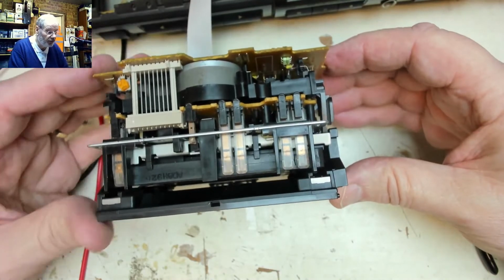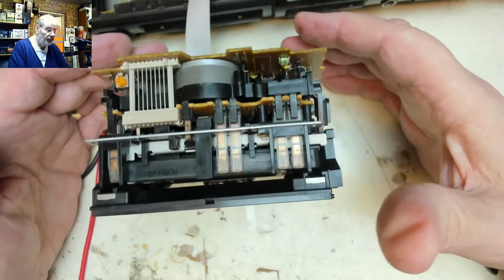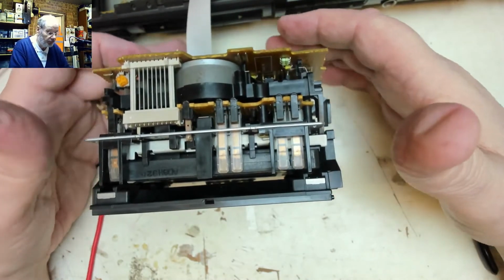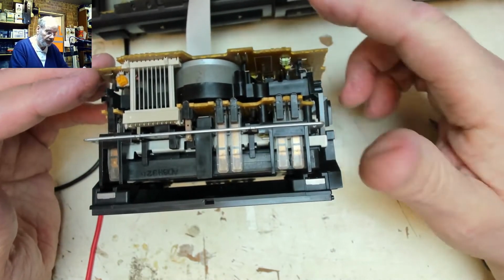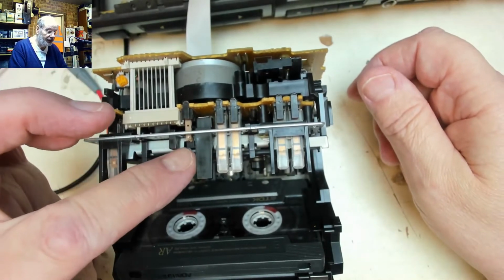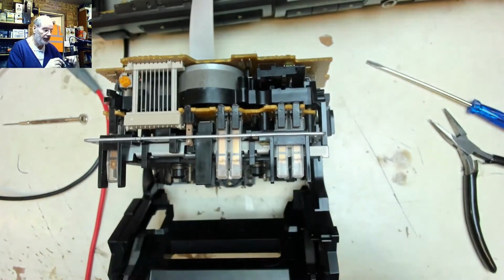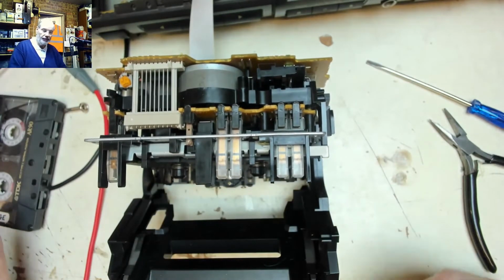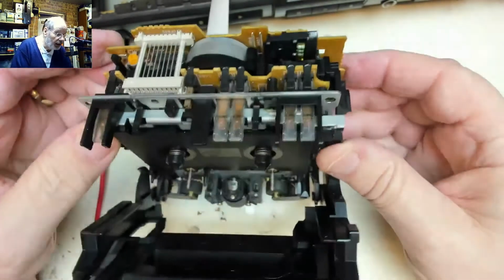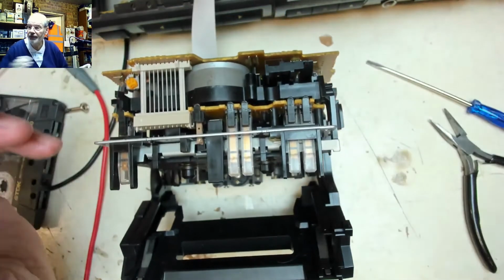Auto reverse, play in the opposite direction, stop, eject. Problem solved. A little tiny leaf switch was just bent, making contact that it shouldn't do. And that's switch S971. Let's have a look at that